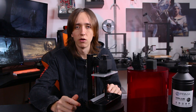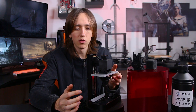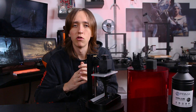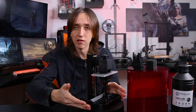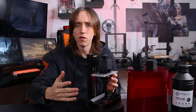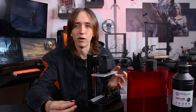What I can complain about is that on the first print, the material would not stick to the build plate. I was able to fix that quite easily by taking really coarse sandpaper — around 40 grit — and sanding the bottom surface. This creates a lot more grip for the material, and after I did that it worked fine. You do have to keep in mind that you want a rather large surface area on the first few layers. As a general rule of thumb, the first few layers should be the largest surface area of any layer. Otherwise you risk that the separation forces — because the print has to separate from the film where the display is every time it goes to a new layer — may rip your part off the build plate.